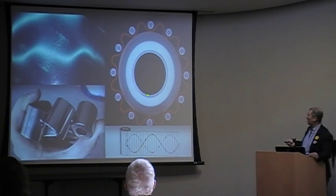You have four elements, a rare earth, the inner element has to be a rare earth, that's your electron reservoir. You have a plastic material, which acts as a gating valve to smooth out the pulses, otherwise they would build up and then dissipate, build up and dissipate. Back in the day, he used nylon 6-6 with a negative charge. Nowadays, we use Teflon. This is the magnetized layer. It's magnetized with a DC combined with AC coil to create an unconventionally shaped magnetic field. Pinpricks of magnetism going all the way around the plates and all the way around the runners. And a copper or aluminum layer, now we use copper as a paramagnetic layer to create eddy currents so that the runners float over the plates. There's an air gap, no physical contact, so there's no friction at all, no wear and tear on this machine.